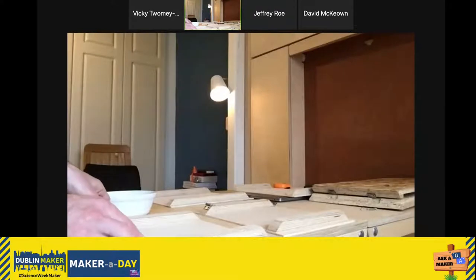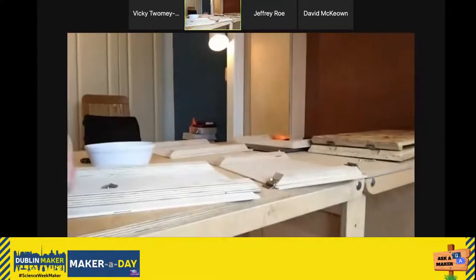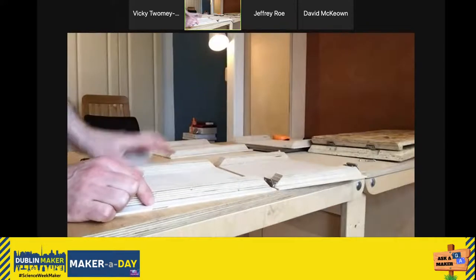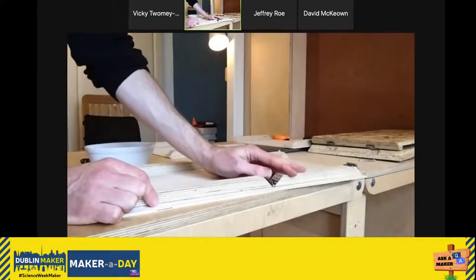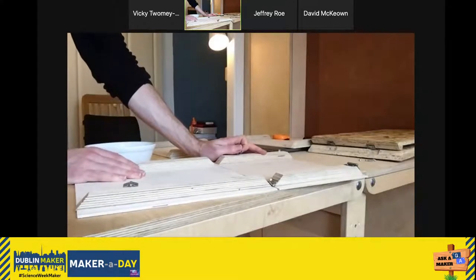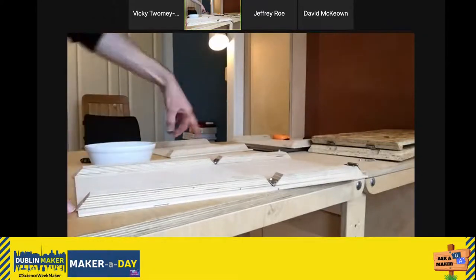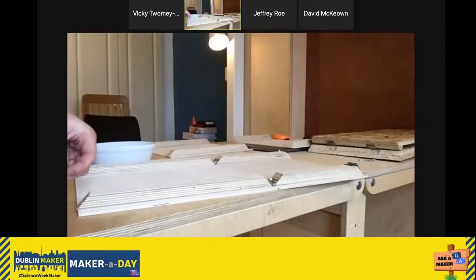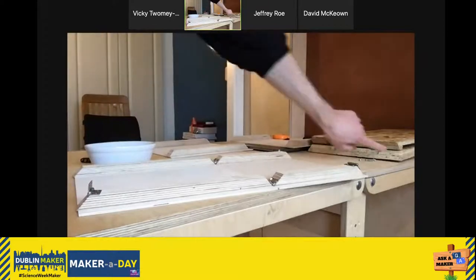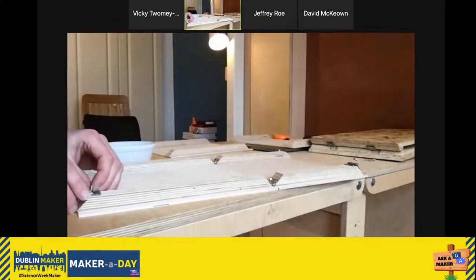And the idea with this is, when we're putting the two sides together, we want the flat hinge. I don't know if you can see this now again. The flat hinge that goes to the external side meets up with the piece of wood here that's going to take the opposite edge of that flat hinge. And the same thing happens then for the other side on the bottom of the box. So this hinge will sit here. And then on the outside, this part here will meet up with the other pieces of wood to form the opposite end of the box. And this will be the internal side. So this will actually sit on top here and receive the internal side. Like we have here, where the miter edges of the box are actually facing away from each other, they open out. That's what's going to happen in this part.